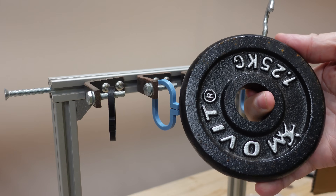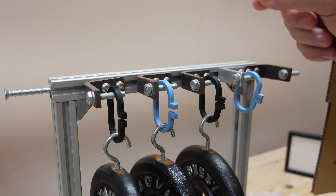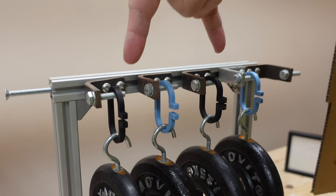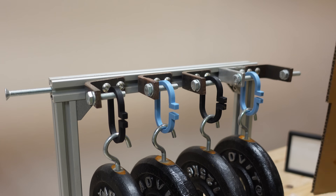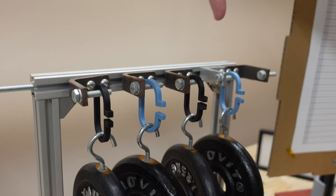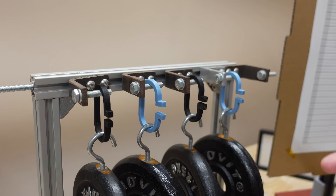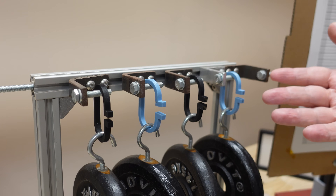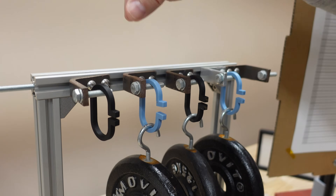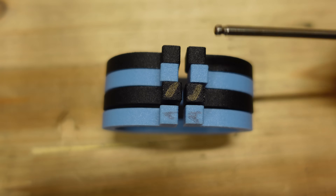The creep test measures deformation under constant load — theoretically annealing should really help here, and these two objects are annealed. I already measured them: noticeably less deformation on the carbon fiber version compared to the glass fiber, and also noticeably less deformation on the annealed version compared to the regular. On day 5 I can see the carbon fiber is still better, and annealing helps. What is new to me is that this nylon almost doesn't creep — almost no additional deformation compared to day 1. After removing the load, almost no permanent deformation, maybe just a little more on the non-annealed versions.